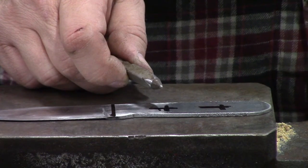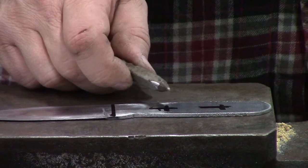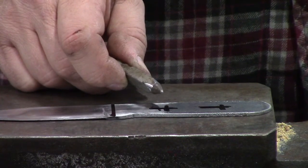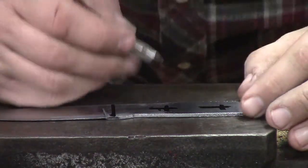If you have a drill press vise, that's great. You can use that and that'll help it. But even with a vise, with these little bits, it sometimes wants to wander, it wants to push around. If you give it a little start, a little punch mark to start in, it drills much better. So we're going to do the best we can to hit the center of these.